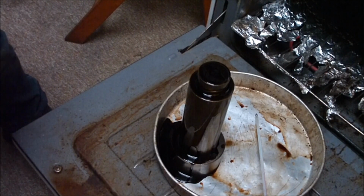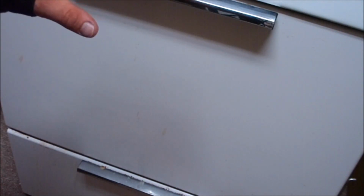So we have our wax back in the oven after we have molded it, and we are putting it in the oven for 15 more minutes with heat on. Then we will turn off the heat. You hear the beeping sound? That means we have to shut the heat off of the oven. And then we will set the timer for 90 minutes of cooling time for the mold.